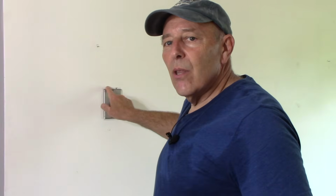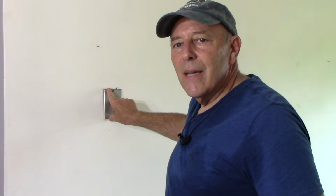All right, so I'm going to show you what you're going to need to use, how we're going to do it, and then we're just going to go right through it and get it finished. I will tell you this, you're going to need a piece of drywall because we're going to need to patch this hole that's in the drywall right here. Now, you don't have to go buy a full sheet of drywall. You can go to the big box stores and buy just a 2x2 piece of drywall, and you can cut out the patch that you're going to need to put on here.